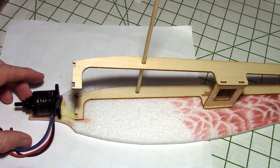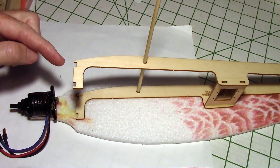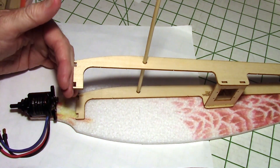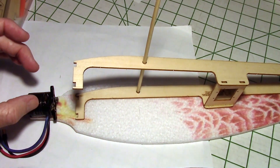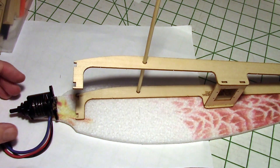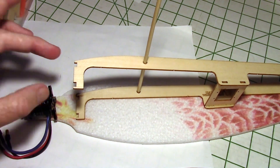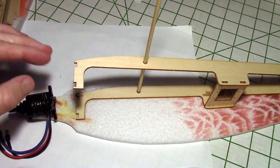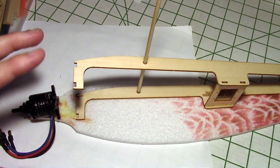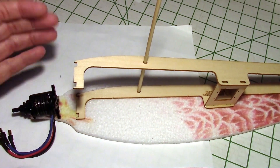They also had the same problem I noticed: if you place the motor right up against that position, you can't get the prop on because the beak sticks out too much. So they had to build a little box to get the motor out far enough to attach the prop. I'll probably have to cut a piece of plywood to fit in these notches and build a box that comes out with the right angle — it also needs to be pitched down a little and to the side a little bit. The box they built already accommodated that.